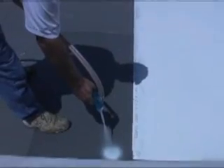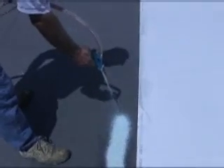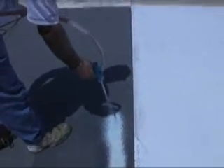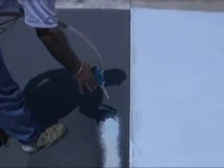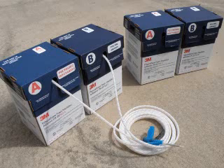When the CR20 cylinders are empty, the color of the chemical being applied will change, indicating that one of the cylinders is empty. The applicator will also begin to sputter and dispense only propellant, similar to a can of spray paint when it is empty. When this happens, it's time to connect the applicator to a fresh set of chemical cylinders.